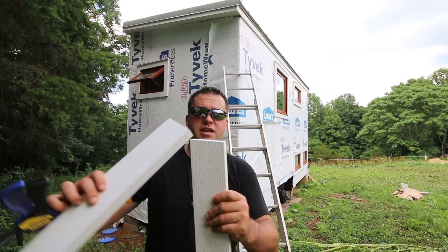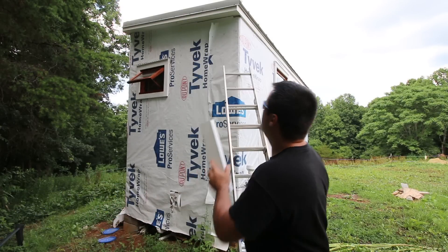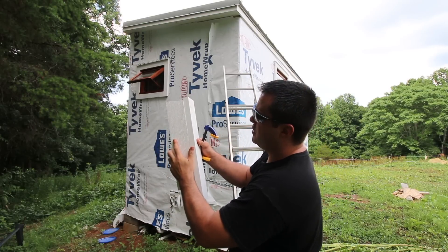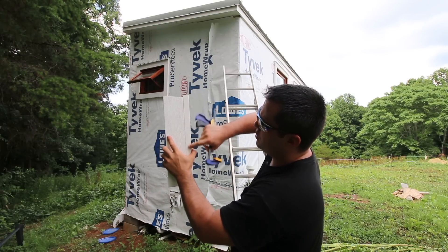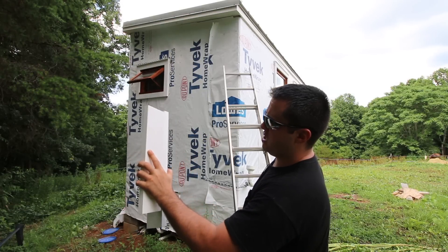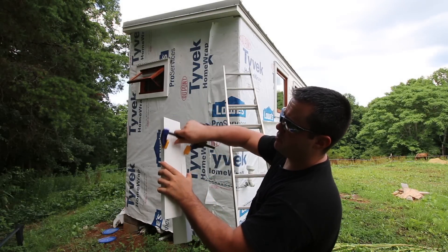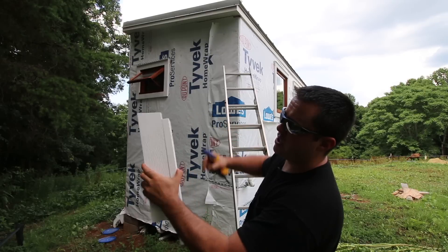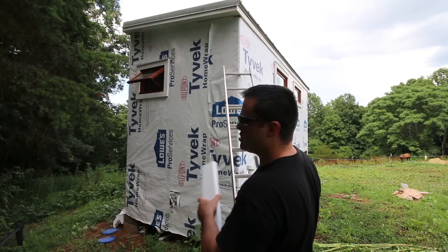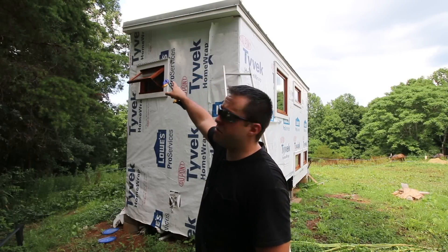What I did is cut one piece at that 7.16 degree angle, and this is going to run into the bottom of the rake edge right there. Then I'll place another one on that. This exposed edge won't have that wood grain, but I'll deal with that. So I'm going to go up there, figure out where these pieces go, clamp them together, get this measurement, and go back to the shop to make this corner as well as that opposite corner.